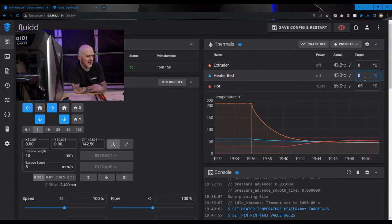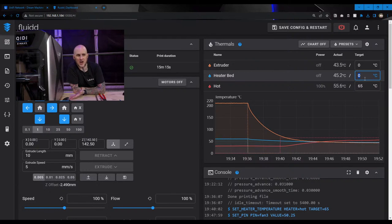Well, we're at 55C in just under 10 minutes, which I wouldn't hit on any of my other machines in the chamber temp in an hour. It would take at least an hour of baking to reach this kind of temperature. And we're at 10 minutes to hit 55C from room temperature. So that's the benefit of a chamber heater. We've not only achieved temperature quickly, but it'll maintain temperature.